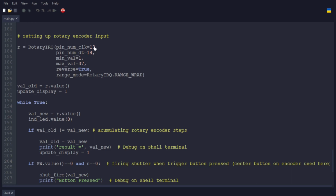And if the rotation is the wrong direction, you can always reverse these two, or even set this reverse to false. That'll cause the rotation to work the other way. Because the way I currently have it set is clockwise increases the time the shutter's open, counterclockwise reduces it,